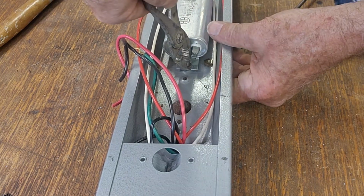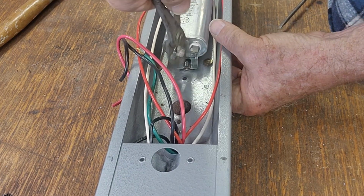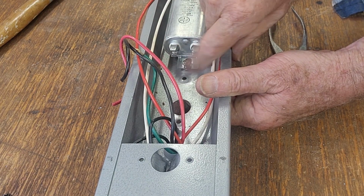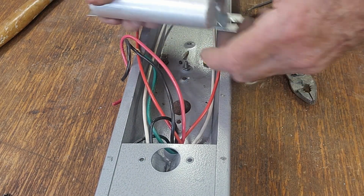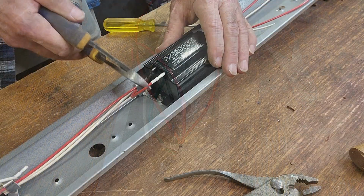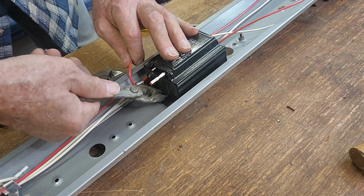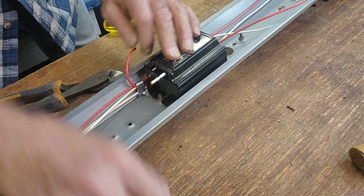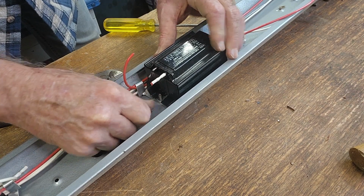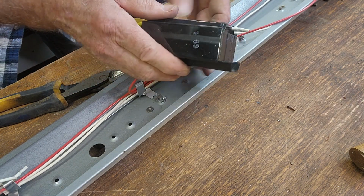Okay, we'll get onto this nut with the pliers. And once they're loosened off, they do undo very easily. Our capacitor can just go in the irony aluminium bin. I'll snip the wires on the ballast, and again just loosen the screw or the nut, and once we get it loose, we can spin it off. And the ballasts are very heavy, so that'll add up to some good weight for us as well.